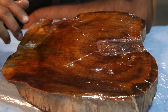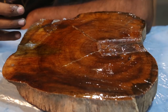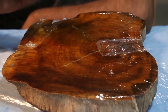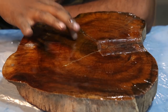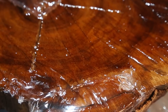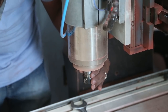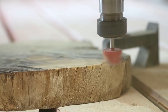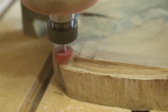I feel that this surface is coated even better because it is a flat surface compared to the other side. I will let the wood cure and suck in all the resin the entire night, and then tomorrow I will come and start facing the surface. I am already seeing a lot of bubbles here which is a good sign. Now I can mount this piece to my CNC table and start planing the surface. I am going to hold it by two sides and slowly plane it, and for that I am using this 30mm diameter wood router — which was a bit of a mistake.